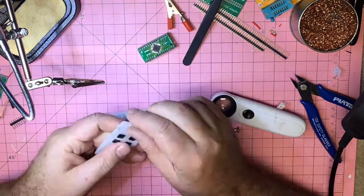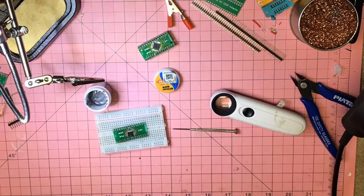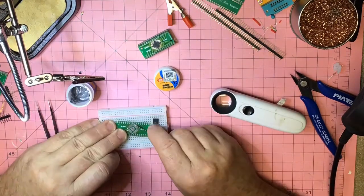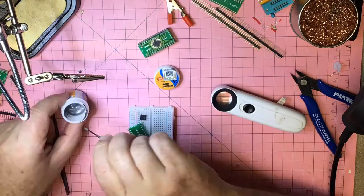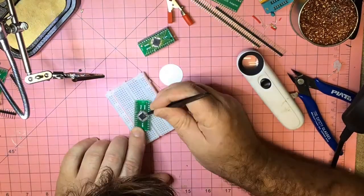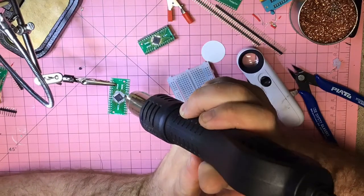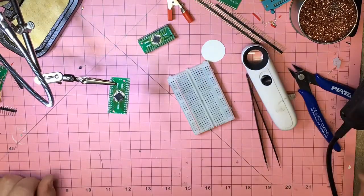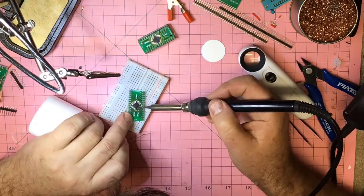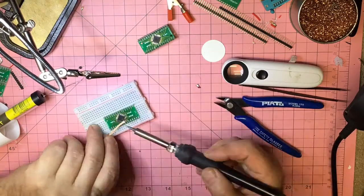With the second chip I'm going to use some solder paste — liquid solder, I guess you'd call it. I'm just smearing the solder paste onto the pads with a little screwdriver and then placing the component. Then there's a hot air gun at around 320 degrees — as the solder paste melts, the component just gets attached to the pads pretty easily. This is a lot faster way of doing it, though there were still a couple of bridges.